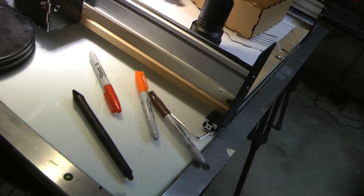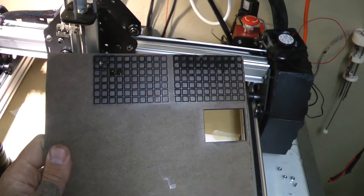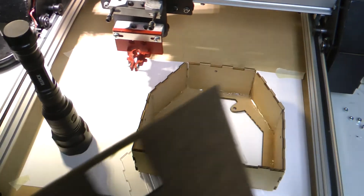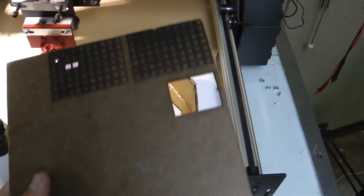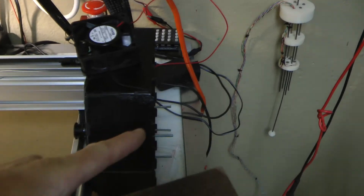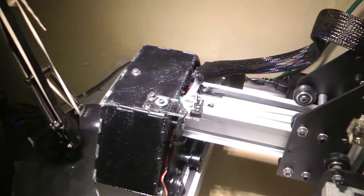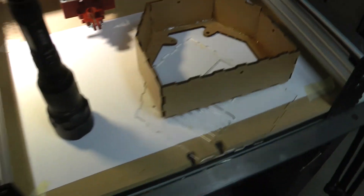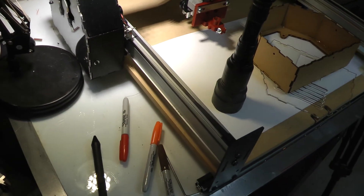This is just the prototype — that's not this material here. This material is higher density; let me show you this board. It's easy to paint but you cannot sand it at all. If you sand it, it's going to get fibrous — you can see where it's got some flaws in the outer area. Don't sand it, or use very fine sandpaper if you do. Alright, I just wanted to share that before I go — enjoy.